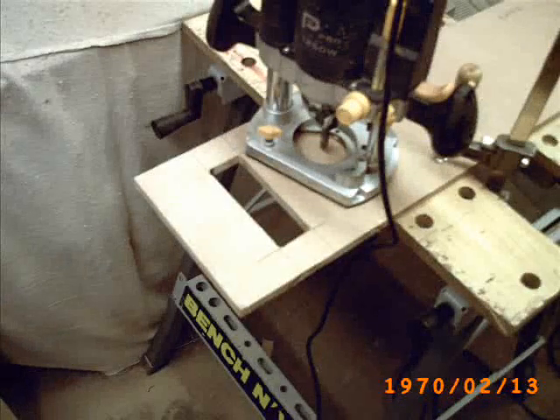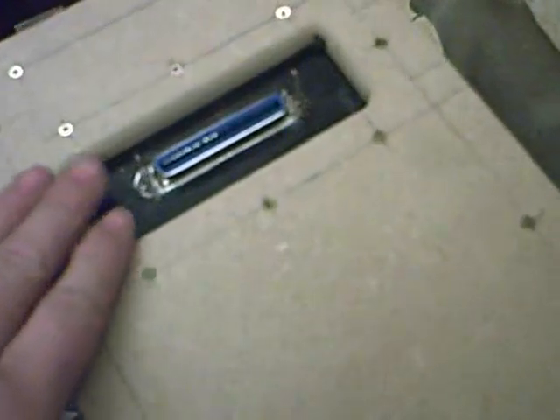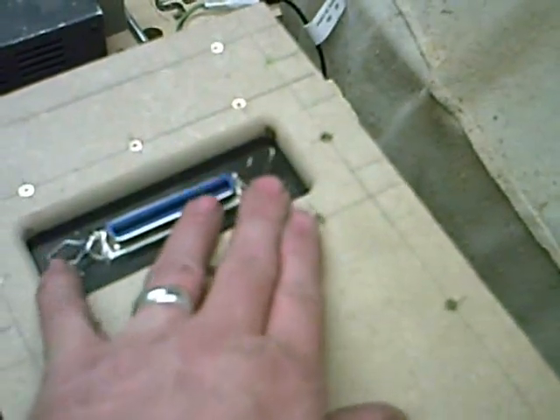As you can see here, we have the flyback diode fitted to stop any spurious sparks going back down into the MIDI board. All the wiring goes down and terminates on the board there. Running down to the bottom end, that's where you just plug in to the MIDI board — it plugs straight in, carrying the negative and everything. The diagram will explain a bit more of that for you.